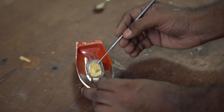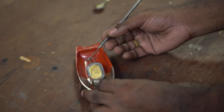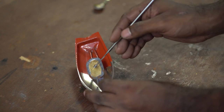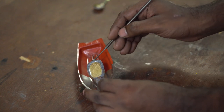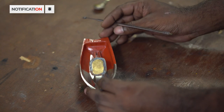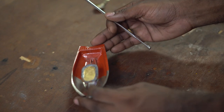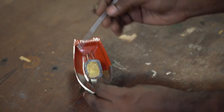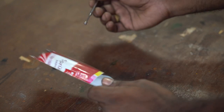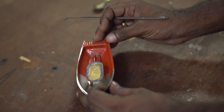Before starting the engine it has to be primed with water, so there is water present inside already. When you place a candle, the water inside starts boiling, becomes steam, and expands. As it expands, it tries to find a way out and goes through one of these tubes. By Newton's third law of motion — every action has an equal and opposite reaction — the steam goes out one way and propels the boat forward.